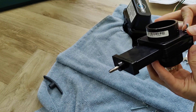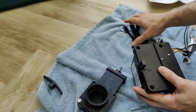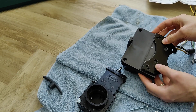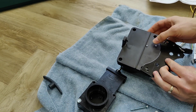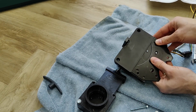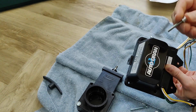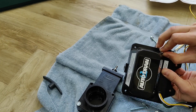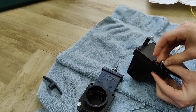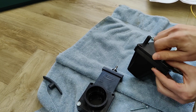We're going to set that aside and pick up this device — the device that's going to actually move the valve for us. We have to make sure we put this on in the correct direction, because if we put it on this way the screw head is not going to allow this to work correctly; it's going to be off balance. So we need to turn that around, make sure the screw head is in the middle of this hole right here. Take our bolt, take the washer — make sure you use that — and put that through right there. Then just kind of lightly tighten up this lock nut; we'll go as far as we can by hand and tighten it up later.